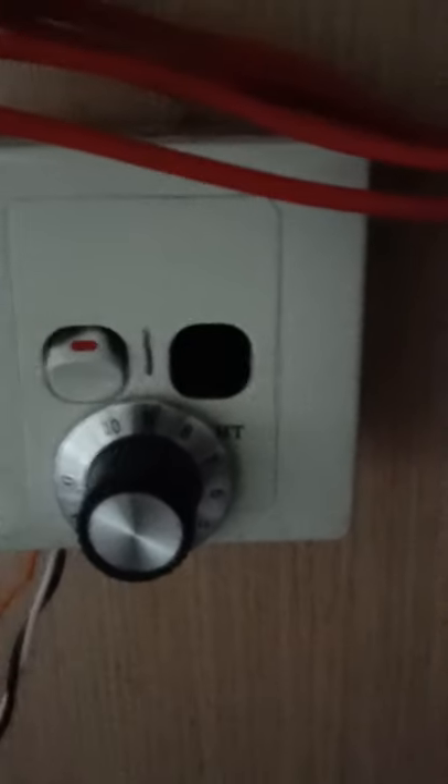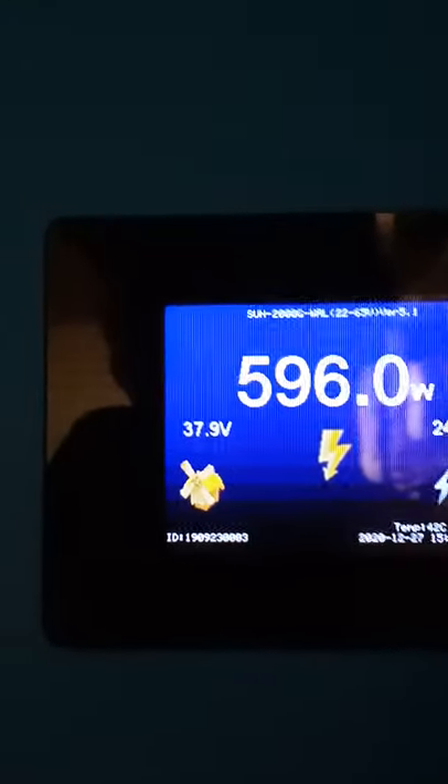But when there's a big storm like this, I find I need to actually increase the braking threshold a bit more. Checking the voltage — it's around 35 to 38 volts at the moment. The wind just dropped when you trust it — normally you get a drop and then it kicks in big time. Here it comes. Producing around 300 watts at present off the turbine, so it's pretty active on the roof. And it's just dropped again.